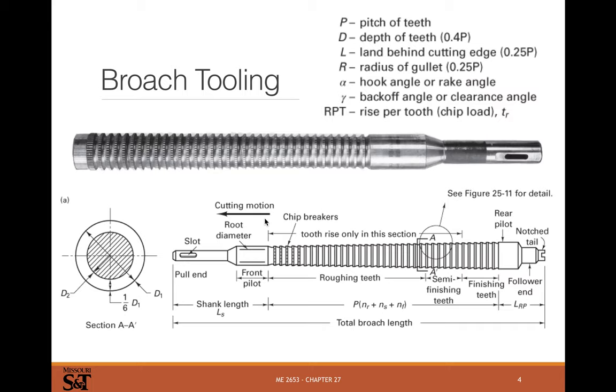These are used mainly in mass production, but for things like splines there's no other good way to produce them. You could cast them in place, but that's usually not strong enough or precise enough. Maybe metal injection molding works for some parts, but if you need a hardened steel spline, you pretty well need to broach it and then heat treat it. There's just not a lot of good ways to make internal sharp-cornered features. Rifling in barrels is also done by a broaching process.